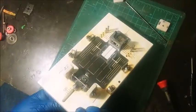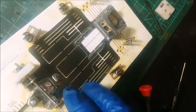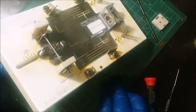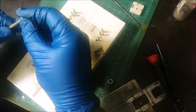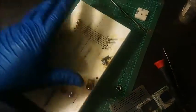Alright. Go ahead, and I got a nut on the top. The bottom is a socket head cap screw, so you can kind of lock that down. So we're going to go ahead and loosen that. And you'll see underneath the guide flag, before I solder the guide flag, I have some stainless steel washers. That's what actually sets the elevation of my guide tongue. Okay. So I'm taking that out. I'm going to end up dropping this back in there eventually.